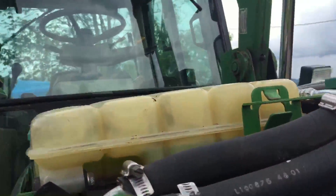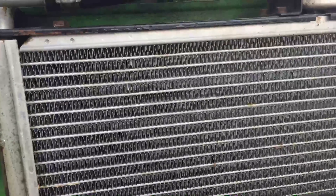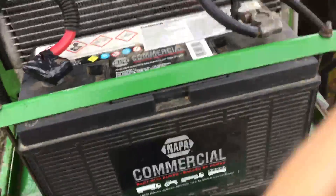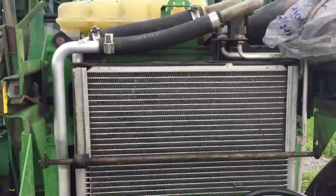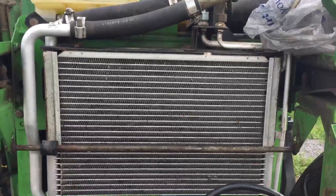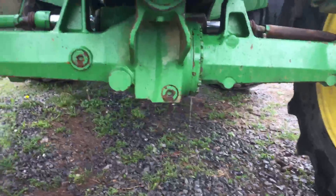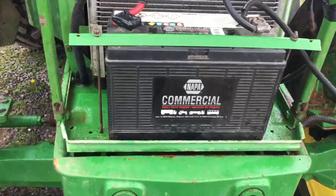So what I did is I'm just going to start with this now — I filled the cooling up. I got some Gunk stuff for radiators and sprayed it in between there, came around and sprayed it in there. Water passes through the radiator really good. You spray it on there, wait 15 minutes, it foams and does its thing, then you spray it out until the water is clear, which took quite a bit.